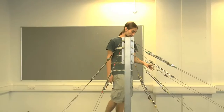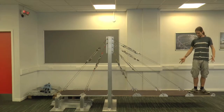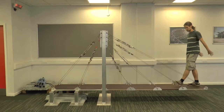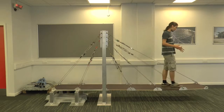If you consider the load case of someone actually walking across this bridge, there are two quite interesting things to consider. The first is that each of these bridge deck panels kind of operate independently of the others. So while standing on the farthest one, there's actually not a lot of tension in the wires closest to the pier — they're actually pretty slack. All the tension is being taken by these two, and it's actually being transmitted through compression of the bridge deck back to the piers and the tension of the cables. The other thing to notice is that while walking across the deck, it's deflecting but then bouncing back. And on bridges larger than this, this can actually set up a really interesting and quite dangerous phenomenon.